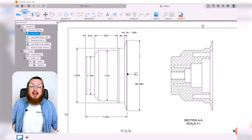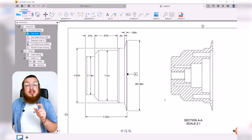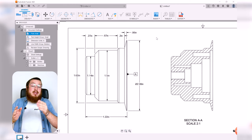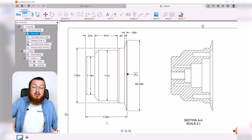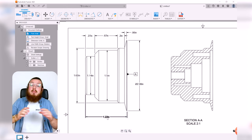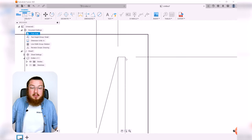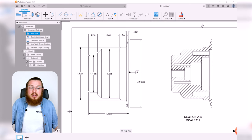For this project, we're just going to say that all the dimensions on here, unless stated otherwise, have a tolerance of plus or minus 1/1000 of an inch. But there we run into an issue, because if we have these 5 widths that get added up along the entire length of this part, then it may be 0.005 inches too large or too small on the other end. That exceeds this total width, which means I have to say either this has a much larger tolerance or much smaller tolerance, or I have to add another dimension for this teeny, tiny little plateau right there. And for me as an engineer, it's going to be a lot easier to denote it down there. So we've got 5 pieces that may be plus or minus 1/1000, so let's add 5/1000 plus or minus on there as well.